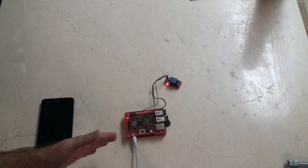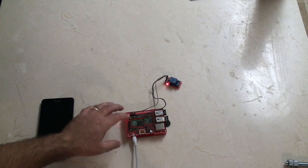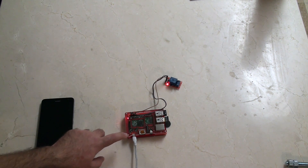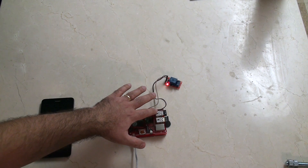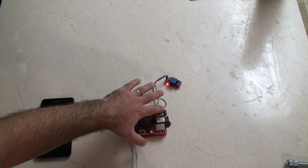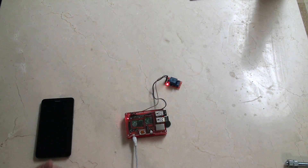An important part of this project is the ability to control the light when not stood in front of it. What I've got here is a one channel relay and a Raspberry Pi model B+. There are two dongles — one is a wifi dongle, an 802.11n dongle I got on eBay. Some of you have asked which dongles work; the truth is it's very difficult to determine. I suggest you look on the eLinux page to figure out which ones are compatible.